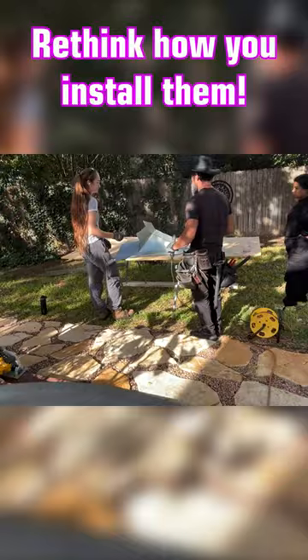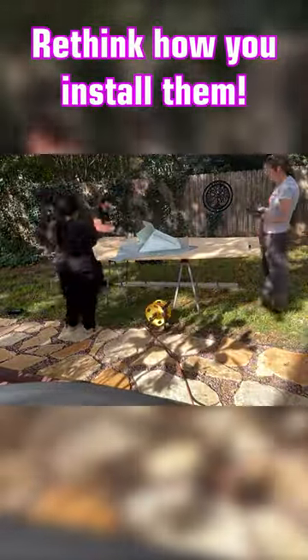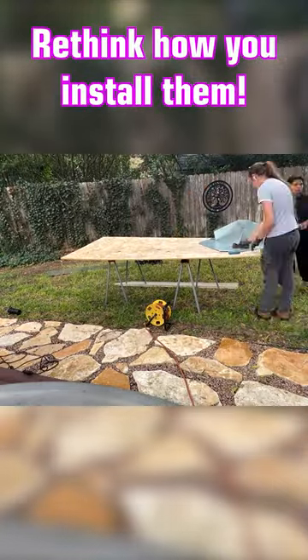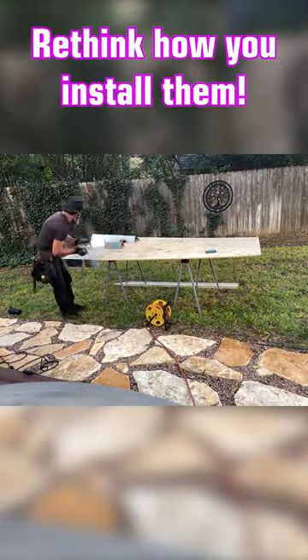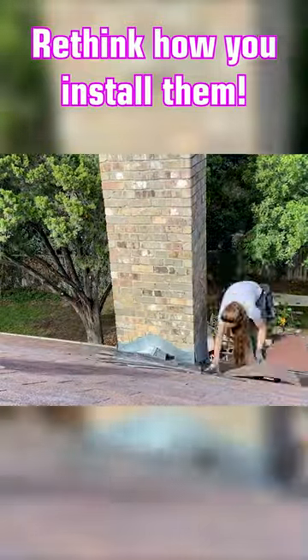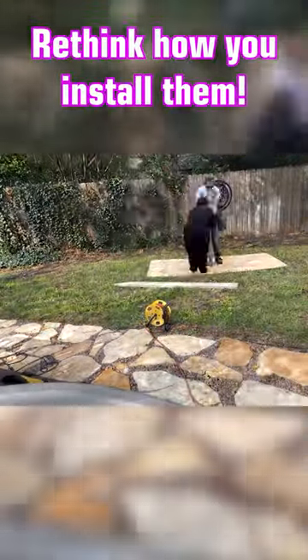About five years ago, we realized that over probably 80% of our leaks were coming from chimney crickets. And so on every re-roof that we do, we completely redo the chimney flashing and we custom solder it on site. This is very unusual for roofers to do, and we're extremely proud of how we do it.